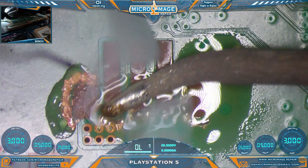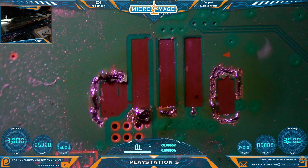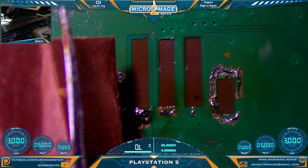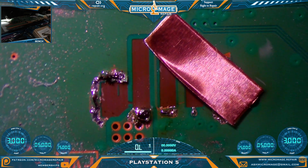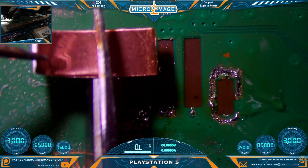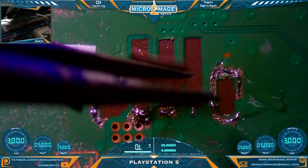Our makeshift pads — there's solder on them. Apologies for it being a little bit darker, but I need some indirect lighting for the next bit of work. Anyone who follows me knows I like to use the copper tape method for these. We're going to eye the size we need here. This one will probably be our anchor. We're not using copper tape for the adhesive — we're using it because it's copper, it's flat, and it makes for a nice new pad. That'll work fine, and that will work for the other side.